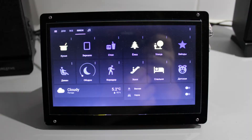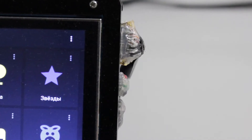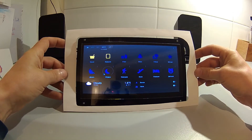This template looks crooked and offset because I want to have the actual display area centered in the new frame. As you can see, it's not actually in the center of the original assembly. Also, these connectors that I can't move anywhere add some additional challenges to the overall geometry. So this is the smallest size I was able to get this design to and still have the actual display in the center.